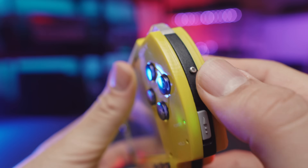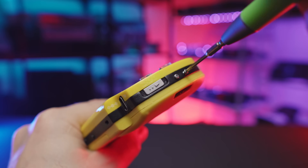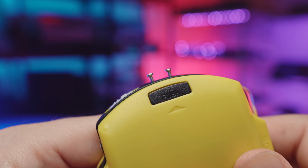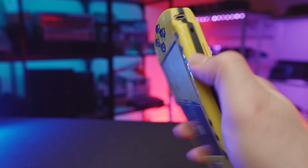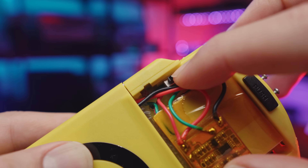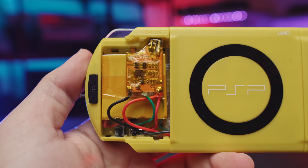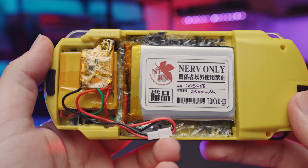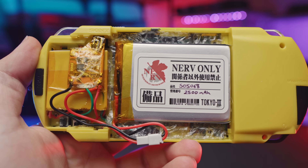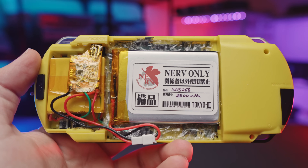That's one reason why I went with these screws — they're nice and small, have little edges, and fit pretty discreetly. You can fully unscrew them for a flush result, or unscrew them halfway for more of a protruding effect. On the bottom trim, we have an ergonomic switch to activate the Pika function, and to prevent accidental termination, we have a safety switch. Looking at the battery compartment, we find the taser module as well as the battery BMS. We opted for a custom battery that replaces the UMD drive — a 2500 mAh battery that's compact and has plenty of juice, with room to upgrade.